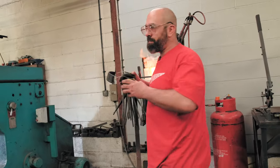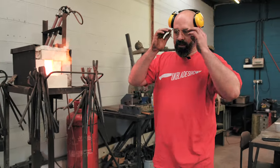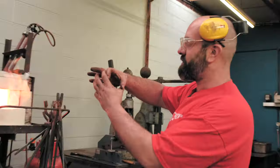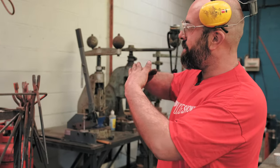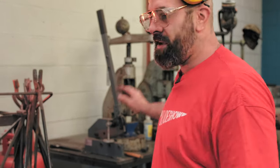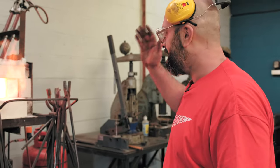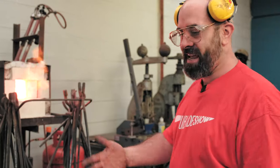This is now up to welding temperature. What we've got is all of these grains of steel where the boundaries are breaking down and the crystal structure is kind of enlarging and going across those two different steels — and that's helping it stick. We're not getting it to the point where anything's melting, we're not chucking flux on it, we're not introducing any foreign things to it. It's been sat in there, it's all got contact, it's all soaking — the chances are it's stuck. And there's one way to find out: hit it with a big bloody hammer.